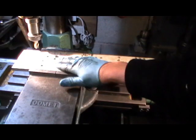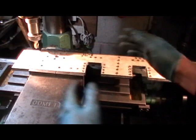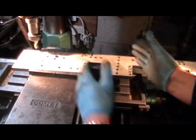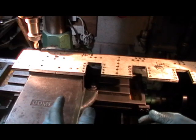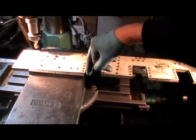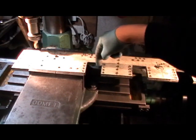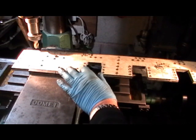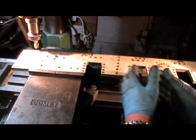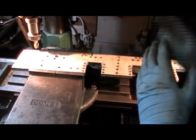I pushed my vice up to the end, set my frames up in my vice, and supported them on some parallels on the bed. I clamped everything down, then got a 5/16ths cutter in my miller. I did the front two first because my traverse on my table is only 11 inch, so I had to move it over in two sections. I went within 30 thousandths of my lines, milled round, and that all dropped out. Then I continued milling to the final dimension and got that within a thousandth of an inch.